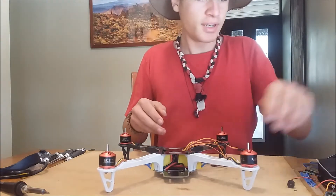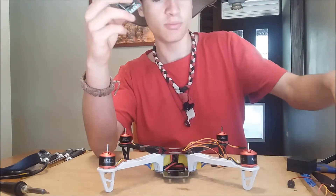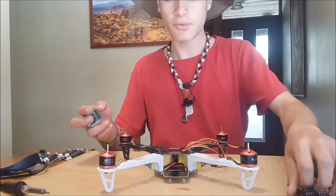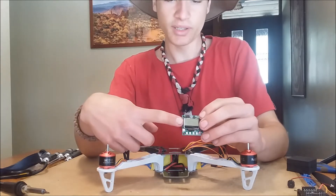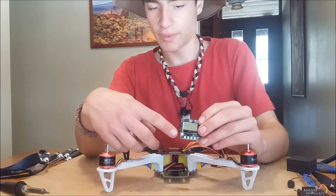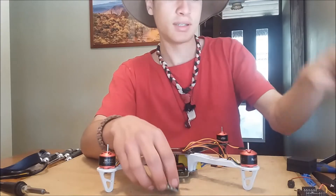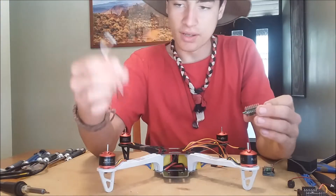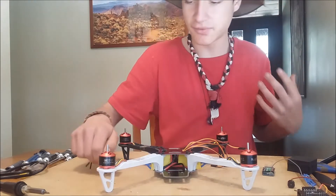Now we can move over to the front and connect our KK mini board. Like I said, this is a budget build and most of you are going to want to upgrade to a better flight controller. I'll tell you quickly how this works: on this side you plug in your receiver pins — you've got all the channels: rudder, elevator, throttle. At the bottom you've got ground and positive. I'm using this receiver and my Turnigy i6 remote. I'll solder on my wires to the KK board, plug it into my receiver, mount it up, give it a test flight, and see if it works.